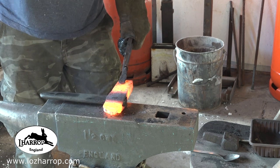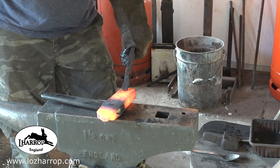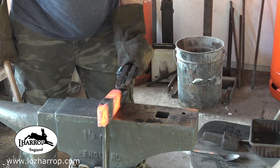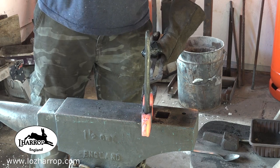After that it was just a matter of flaring out the end where the tongue is — spreading it out, thinning it down. Then into wood ash for the night, muriatic acid etch, and then on the grinder to shape the head.